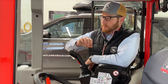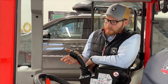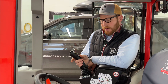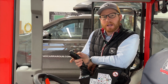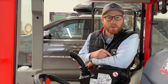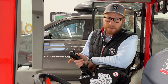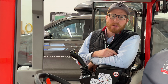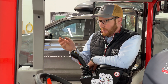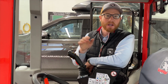You also have the ability to control the flow on all of your double acting remotes. Typically you've got one button controlling two remotes. With your presence switch, for instance, hold the red button and go forward and back — you're controlling the set of double acting remotes with red caps. Hold the red button and go right or left and now you're controlling the flow out of the remotes with the brown caps just below. That's one way to efficiently operate remotes without pressing so many buttons — basically two functions with each button.